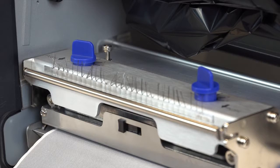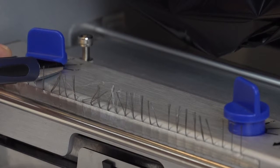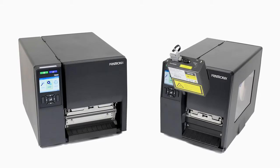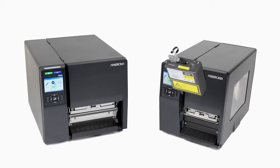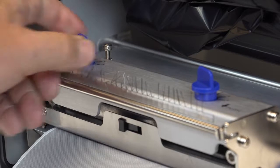We suggest adjusting the knobs for even pressure. Adjust the left and right printhead pressure knobs when changing to media and ribbon with a different width. When using a 4-inch wide printer model with 4-inch wide media, or a 6-inch model with 6-inch wide media, adjust both printhead pressure knobs — left and right — to the same level.